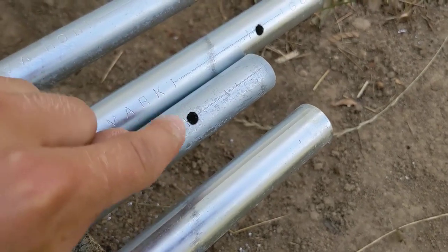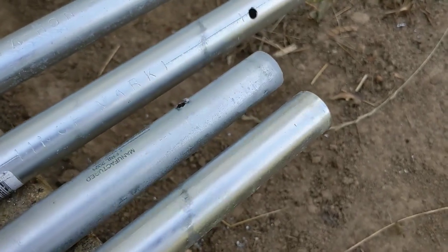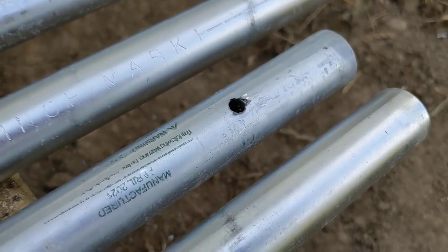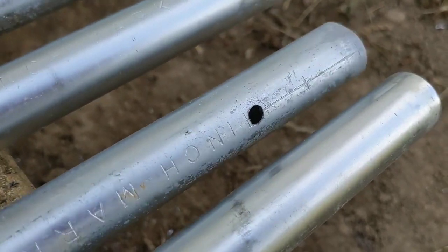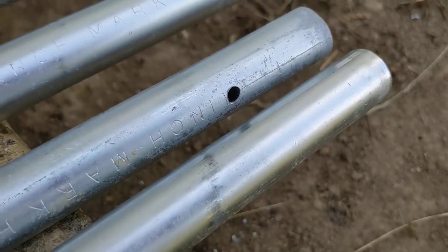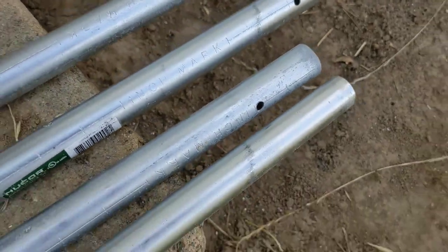And the other thing is, drilling through the other side, I basically just drill straight through. So once I'm through the side facing the cage, I just continue and drill straight out the other end. So you're probably gonna get some burrs on the other end. As you can see, I got a little metal piece of shrapnel there. Also, it's harder to tell where the bit is gonna come out, so it's important to drill into the side that's facing the cage. Otherwise, you run the risk of having your holes possibly an 1/8 inch or a 1/4 inch to the left or to the right of where you want it. So just a tip for you guys there. I'm gonna finish drilling these holes here.